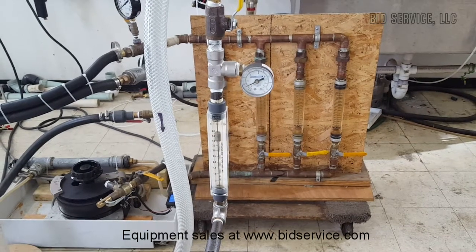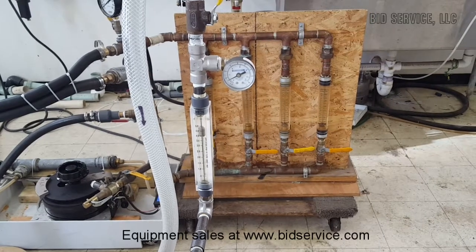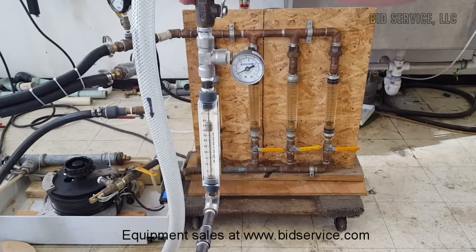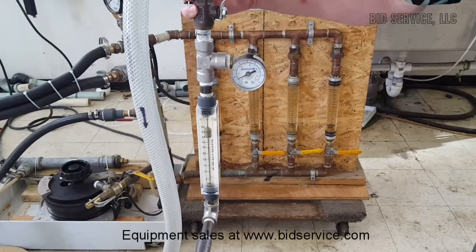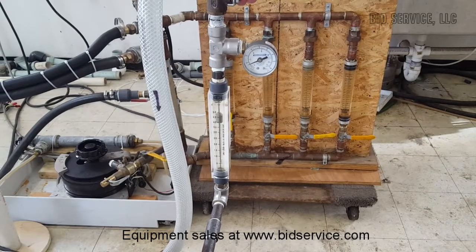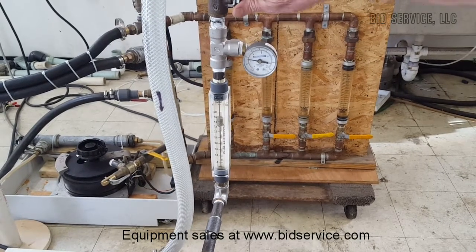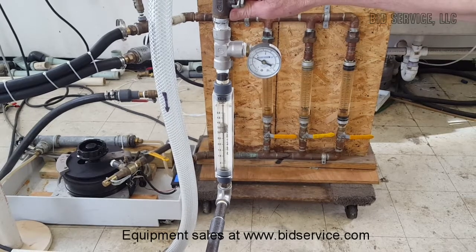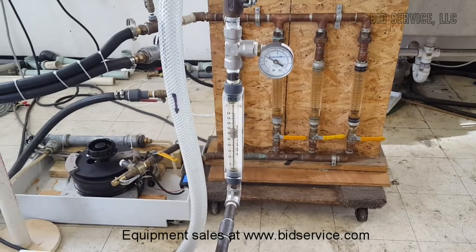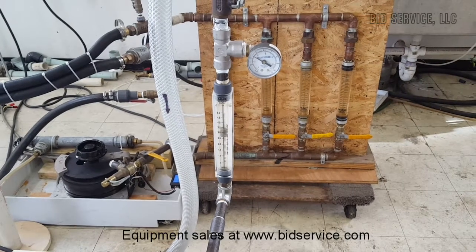For the temperature to come down. This has, as I mentioned, a PD2 pump, which will put out about 3.5 gallons per minute at 50 PSI. This is my little throttle valve that I have here, my little homemade device that works very well. So I'm going to raise this up and push this to about halfway, between about 50. And we are just under 3.5, about 3.25 gallons per minute, which is pretty good.